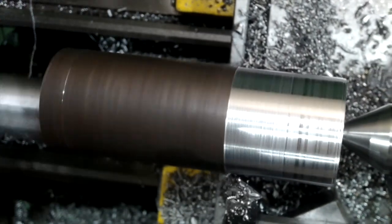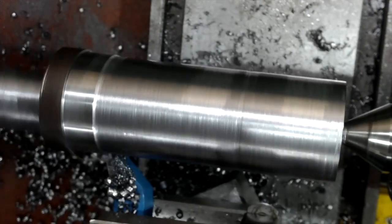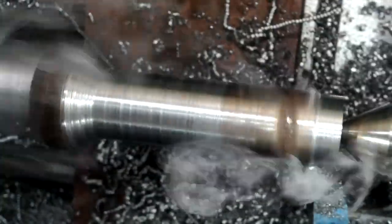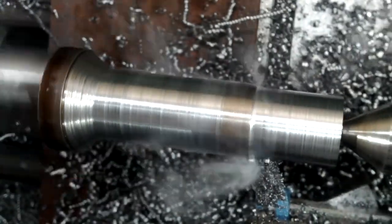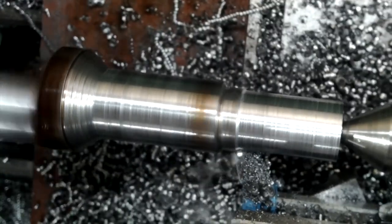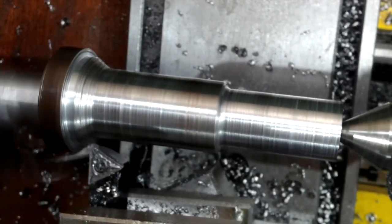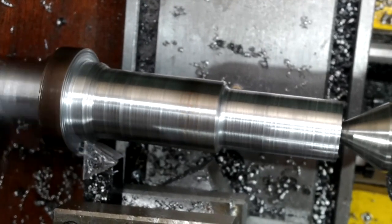The following day I started to complete the roughing out process on the 1-inch dimension. Using a tungsten carbide tip tool, I didn't remove more than say half a mil at a time due to the material not being very free cutting. I used a mixture of old engine oil, paraffin with a touch of J's fluid to lube the cutter. I used it because I've got a fair bit and it's therefore cheaper than buying a few litres of the proper stuff. Despite that, it worked surprisingly well.